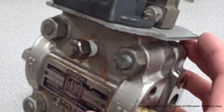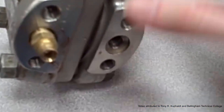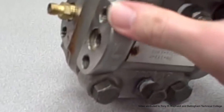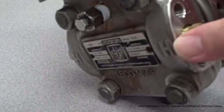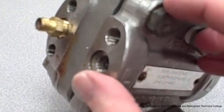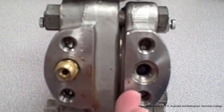Like all differential pressure transmitters, it has two ports: a high pressure side and a low pressure side. On this particular model of transmitter, you can see high and low are marked with large letters that are unmistakably cast into the metal itself. So over here we have the high side, and over here we have the low side. This device is built to respond to a difference of pressure between those two sides.